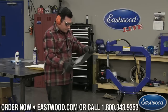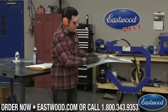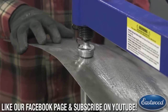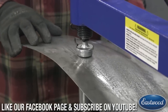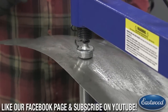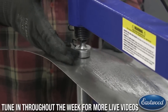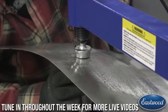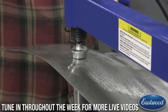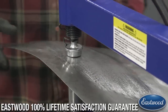So, what you may notice when I was getting into sections that are pretty raised, I was starting to turn the panel to the side like this. You don't want to keep the panel flat while you're doing that, because what you'll do is you'll put creases in the panel. Because when you're turning it like this, you're hitting the edge of the hammer on the bottom anvil or die, and you're going to put lines in the panel. So you don't want to do that. You're going to start seeing big low spots or divots in the panel when you start doing that.